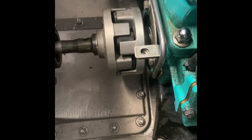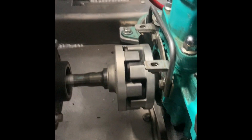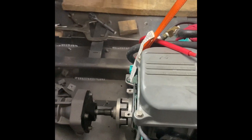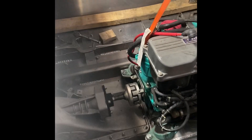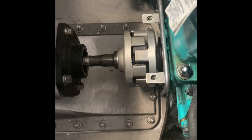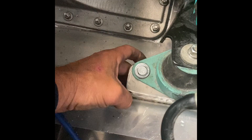The motor is sitting there. You can see when I let it all the way down I get kind of an uneven reveal on the top of the coupling. When I jack it up just a little bit it starts to come free and I can push it back in. I pulled the spark plugs out of the engine so there's no compression and I can rotate it freely by hand — watching the reveal on the top, the reveal on the bottom, and looking to see if there's any wobbling going on. I'm about ready to secure it by marking the insides of those holes, pulling the motor back out, drilling those out, and getting it mounted.